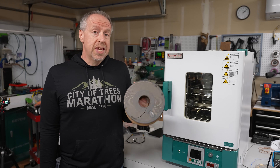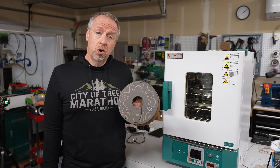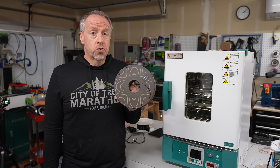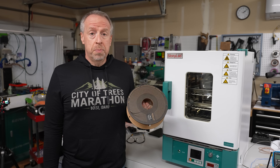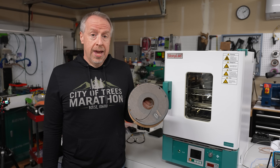This material is called PPACF. It's a relatively new release from Bambu Lab. It's a carbon fiber reinforced nylon material, quite a bit stronger and more heat resistant than other nylons I've used. The technical data sheet quotes its ultimate tensile strength at 168 MPa. That's about double the strength of their PAHT carbon fiber and more than five times stronger than PLA, PETG, or ASA.